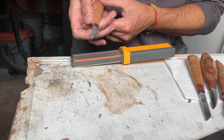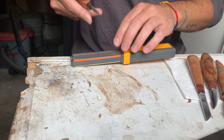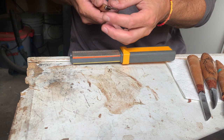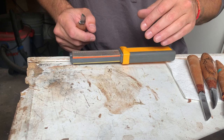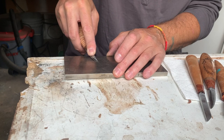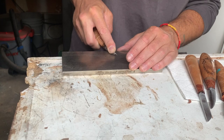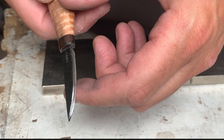I get pretty close with the sanding discs, but you still need to go to an actual stone or sandpaper on a hard flat surface. I would highly recommend diamond stones. Use whatever brand you want for lower grits, but definitely get the DMT brand for higher grits — get the fine and extra fine, which is the red and the green. If you've set a decent bevel throughout the grinding, shaping, and polishing process, you should be able to rest it straight onto the stone and ride that bevel the whole time without guessing at the angle. Up close, you can see the little reflection of the burr on the tip and a few tiny abrasions, but otherwise this blade is looking fantastico.